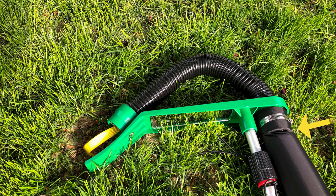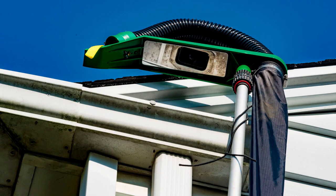Two tips. You want to make sure that the ripstop nylon tube doesn't twist or kink, particularly near the gutter viper head. If you don't see the yellow tongue on the gutter viper vibrating, that means there's no air going through it, and it probably twisted right there. Also, there's a mirror at the bottom of the gutter viper, which makes it very easy for you to look at the downspouts and make sure that you've cleared the area of the downspouts quite nicely.